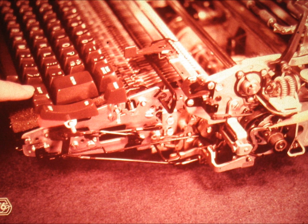Shift in the Selectric typewriter is only an extension of another mechanism called rotate mechanism. The depression of the shift key causes the shift clutch release arm or shift clutch latch, indicated by the yellow pencil, to rotate counterclockwise and away from the metal lug on the shift ratchet or shift clutch sleeve. Be sure to confirm this on the fully assembled clutch of your machine.